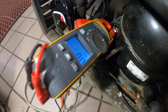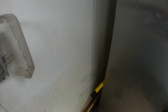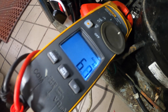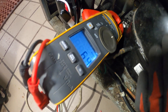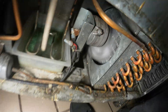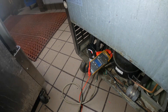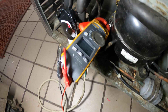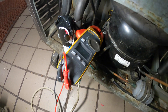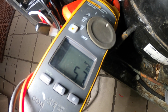I've got my multimeter on amps wrapped around one of the wires. I'm gonna plug it in. 18 amps on start — it came off the start winding — and look, that compressor is running at 6.3 amps. The condenser fan motor is running and everything's good to go. If you wanted to incorporate the run capacitor sure, but this does everything — we're good to go at 5.8, 5.7 amps.